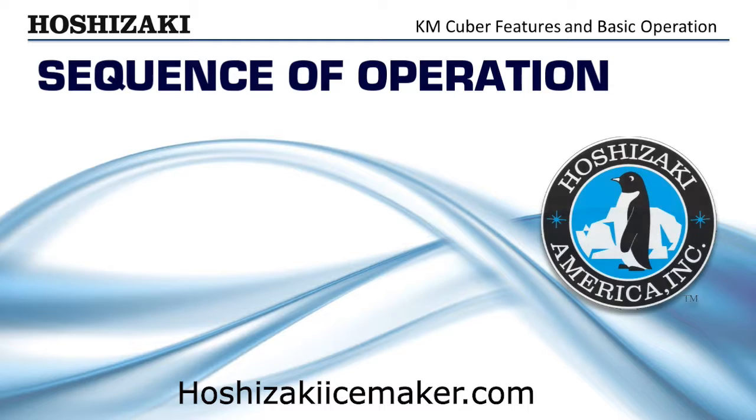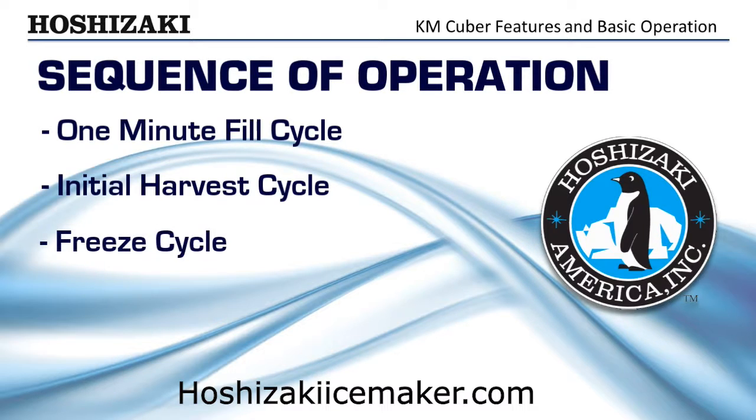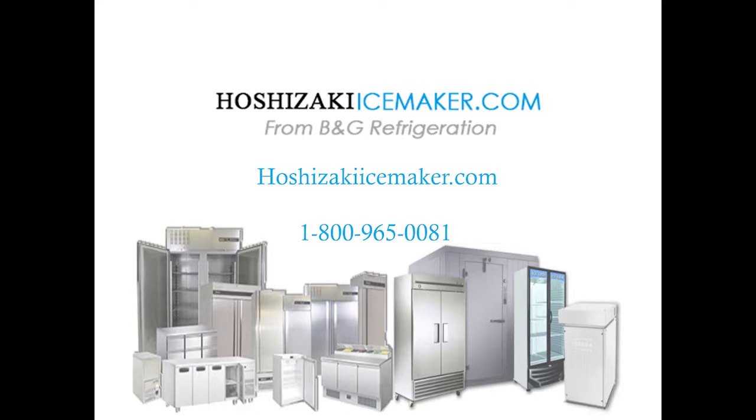The ice maker always starts with the 1-minute fill cycle. The initial harvest cycle clears ice from the plate, assures a full reservoir, and allows quick and easy compressor starting. After 5 minutes in the freeze cycle, the float switch assumes control to initiate the next harvest. The 10 to 20 second pump out cleans the reservoir every 1, 2, 5, or 10 cycles. The normal harvest is the same as the initial harvest and allows the flush to clean the reservoir at the end of this cycle.